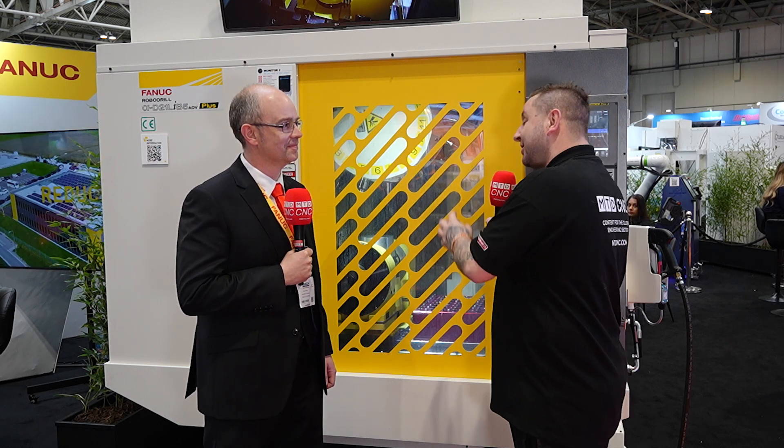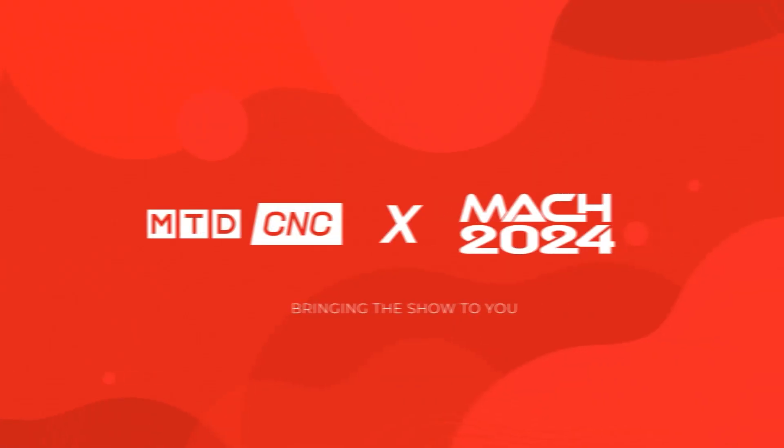How much do you know about the FANUC RoboDrill turning application? We're here to find out from Andy, who is the master of all things FANUC. This turning solution is mounted to a FANUC RoboDrill — the long-bed machine, the biggest RoboDrill that FANUC make, 700 millimetres in the X-axis, coupled to a Nikken DD201 HSR table — a high speed rotary table.